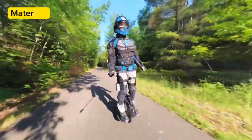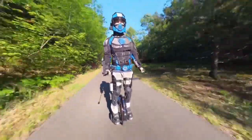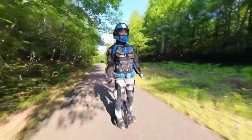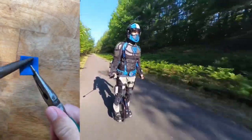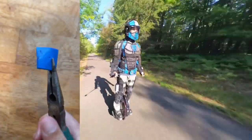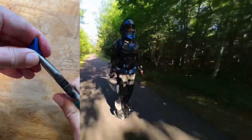I first needed to decide on the best materials to use. It was difficult to find a 3D printable material that was strong and durable enough but wouldn't crack or shatter from impact. I ended up choosing Nylon 910 because it's a semi-flexible, very durable material, incapable of cracking or shattering, and it's rated for high temperatures. Nylon is the only material I was unable to completely destroy during testing.